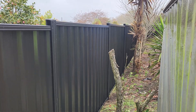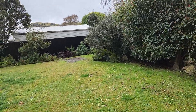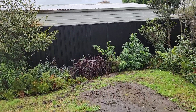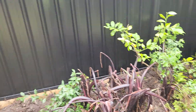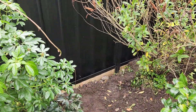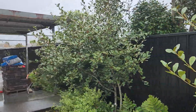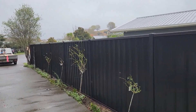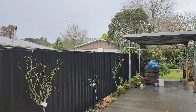A little bit of digging out and messing around too. We've done this little fence over the back here which is probably the more difficult one because it actually dipped down at the back. The good thing about color steel — and I've probably mentioned before — is you can put retaining boards in the bottom. This is just 50mm wide rough sawn timber, necessary where you need to retain the garden so soil doesn't push down. We also wanted to maintain the straight height from front to back, so as you can see this whole entire fence is straight, keeping the height from the front all the way to the back.